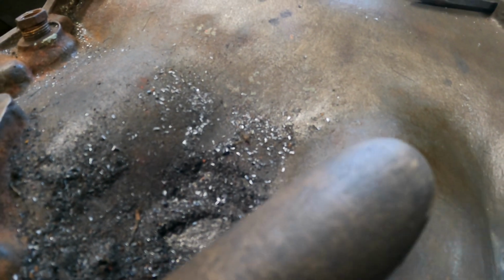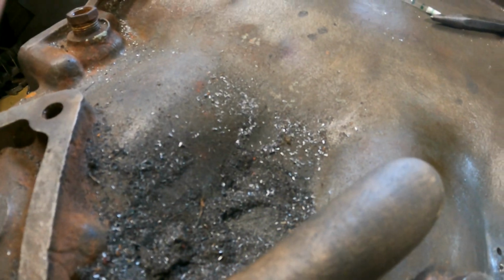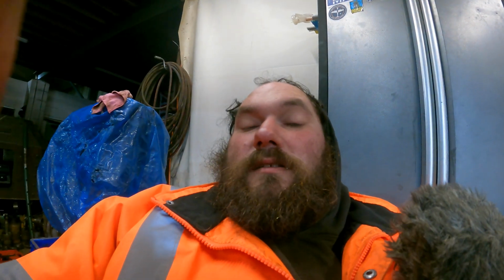It's quite odd when you look at the swarf now, there's actually like proper swarf. You can see the difference between the bright silver swarf from the pins we're putting in, and then the dusty cast iron. When drilling cast iron and tapping it, it's important not to use any lubricant because of that fine powdery dust that it produces. It just turns into a paste and binds up, and you end up snagging your tap and your drill and snapping it. So it's clean and dry and nice and slow. But cast is a dream to tap, it's lovely.